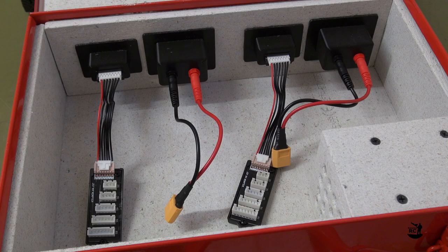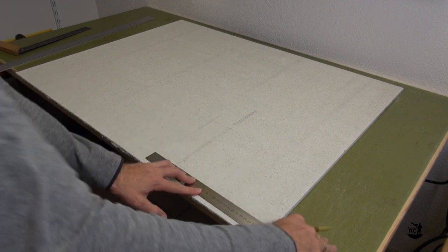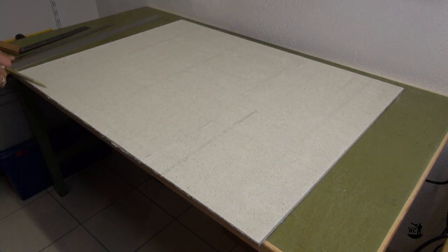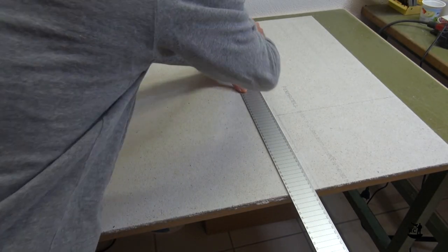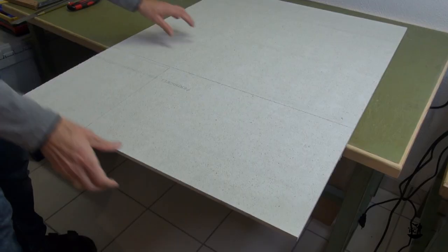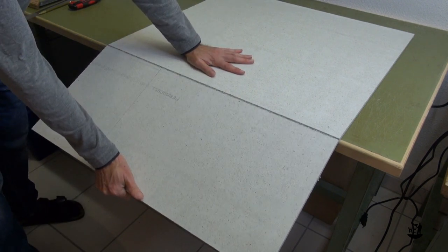The principle is to replicate the connectors inside the box. Now let's grab your box and get your build started. Take your Fermacell gypsum fiber board and mark the dimensions of the bottom plate. You might want to add about 1mm in each dimension, as the board will not snap off with a nice and clean edge. Cutting it a little bit bigger, you can rasp it down to get a clean edge. Use a large ruler and run a box cutter along the line about 4 or 5 times to score the board. Then turn the board and align the score line with the edge of your table. Give it a short shock to snap off the board at the score line.